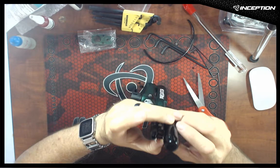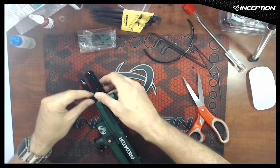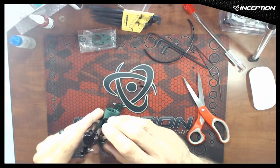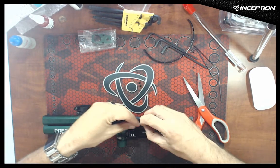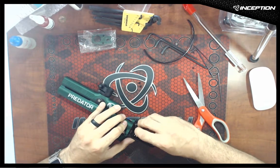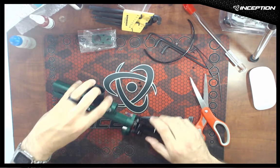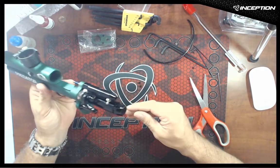I think that looks pretty good. Again, we're going to put two hose locks on. The first one we're going to slide all the way down over the fitting on the LPR, and the second one goes on and we're going to slide the hose onto the three-way and then take a hose lock and slide that down. There we go — second piece of hose looks good.